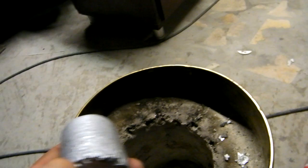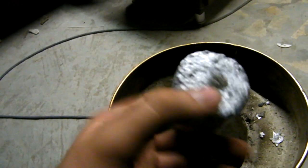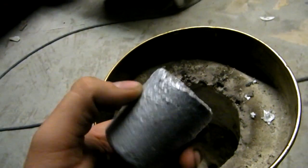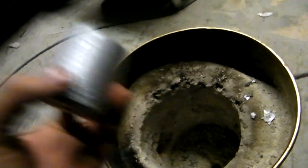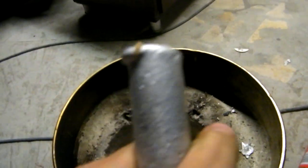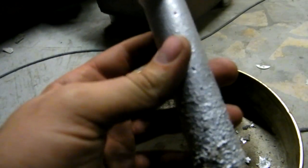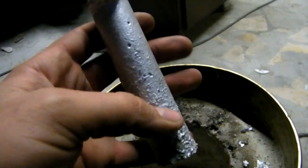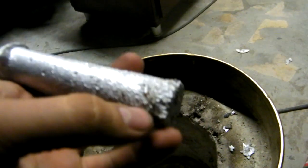Why do you need those frames I talked about in the introduction? Because if you cast in something else, you'll probably melt it — like I did with this one. You can see the crappy bottom. Why compact the sand very well? You can see how nice it is here versus how bad it is here. This is because I compacted the sand very well up top after putting it in the mold, but down at the bottom it wasn't compacted enough — I just pressed it with my finger, I didn't use a rod. At the bottom it's rough, but it doesn't matter because I'll machine it.